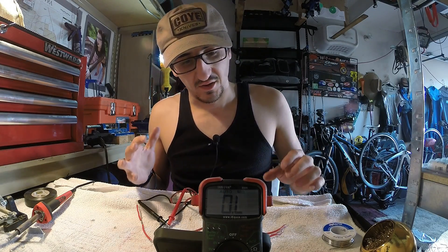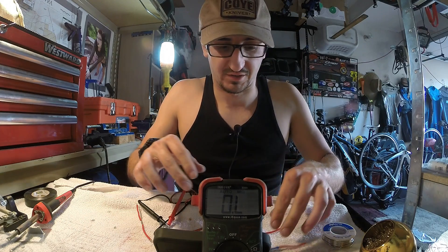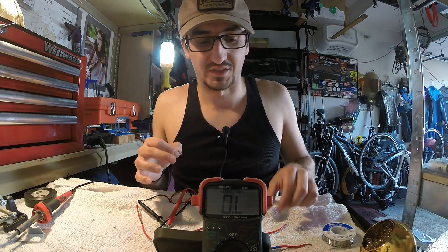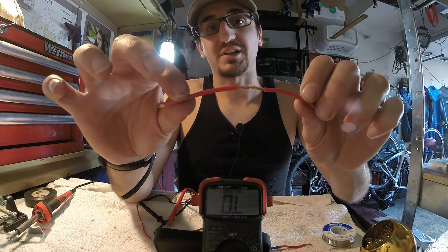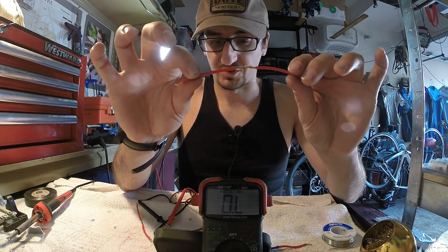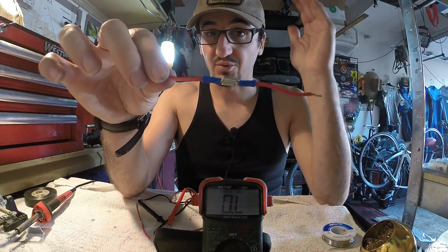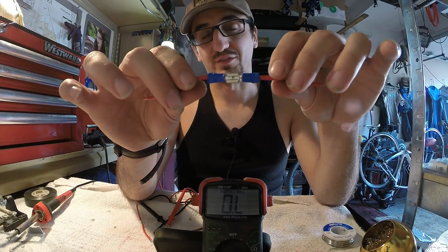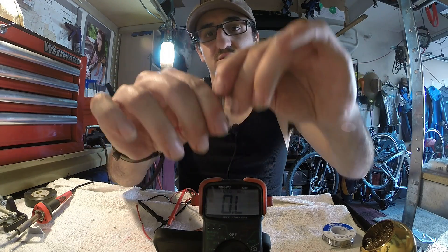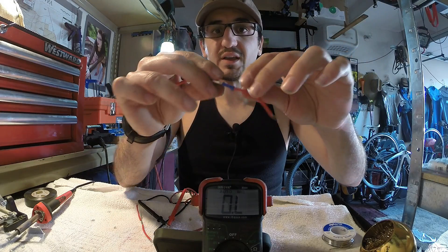So what does all of this tell us? We're going to go from last place to first place. The higher the ohms reading, the worse it is — you don't want resistance. What came in last place was the wire we just spun around. This is going to offer a lot of resistance once it gets loose — never use that method. Next is the crimp connectors. Though they work in a pinch, over time vibration can cause connectors to pull apart and you have an open. Also, the wires themselves can come out of the crimp, giving you an open again in both situations.